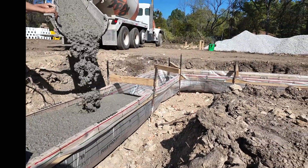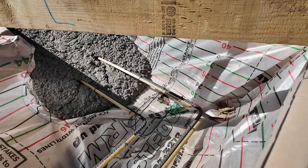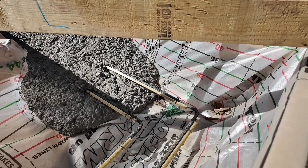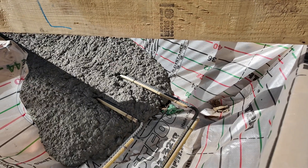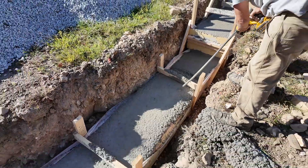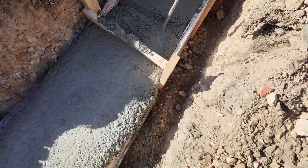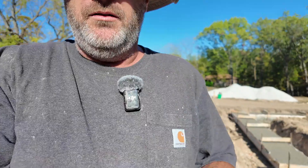You can kind of see the consistency we're pouring at. The beauty of fast foot is that all the rails are set by laser with screws exactly on grade. I'll give a little of the next video away — we had hardly any shimming across almost 500 linear feet of wall. We set all of the Logics the very next day after this pour; four guys set it basically in one day, and we're going to pour those stem walls tomorrow. You can see Keith doing a little vibrating here — it's the only time I had to shoot it. Just over two hours, 44.5 yards laid down on a footing.